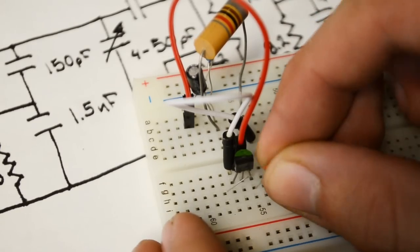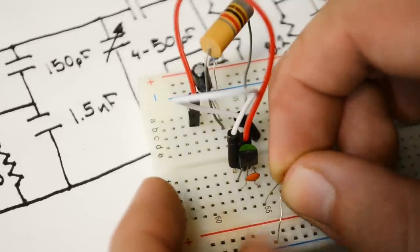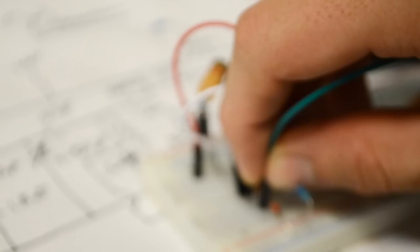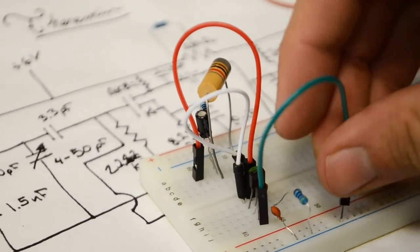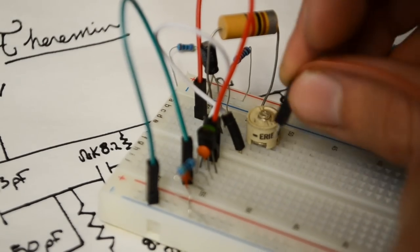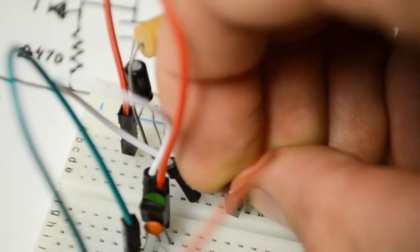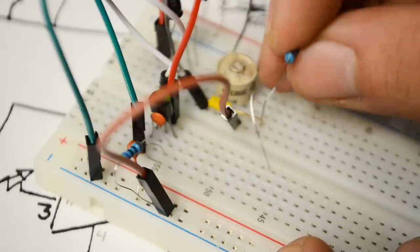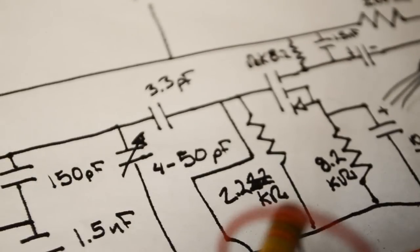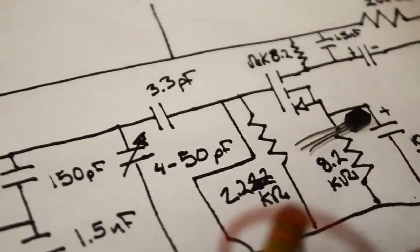The whole left side of the circuit is centered around the JFET, so I'll place it on the rails below and use jumper wires to connect up those components. I'll take a wire from the negative of the capacitor to the gate of the JFET, which is the center pin, and a jumper wire from the open end of the inductor to the drain of the JFET. From the drain to the source we have a 150 picofarad capacitor, and from the source to ground we have a 1.5 nanofarad capacitor and a 470 ohm resistor. I'll also connect the gate of the JFET to the ground rail.